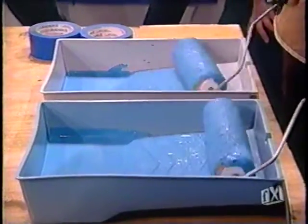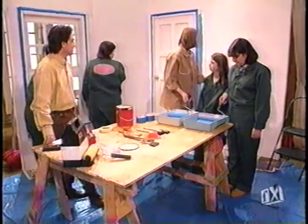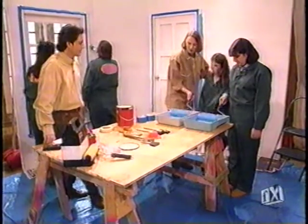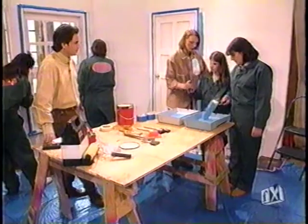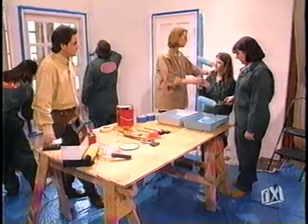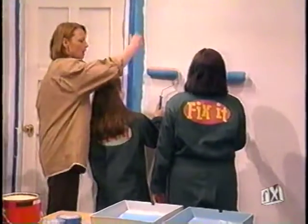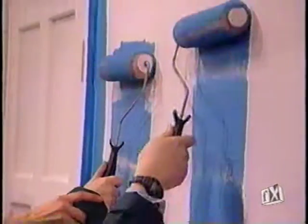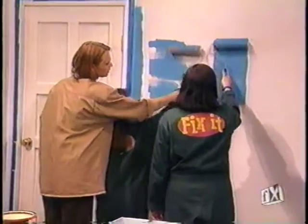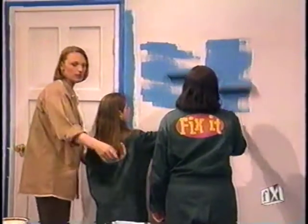Is that cutting okay? That's a pretty decent job for first-time cutters. Now, what you're going to do is hold it nice and steady, come to your wall, and you can start over here or start halfway. You're going to go up and down with the strokes, and press a little bit. If you see choppiness, that's okay — just get the brush started, then re-dip in your pan and go over that again.